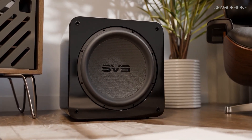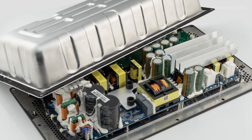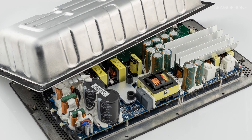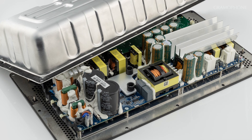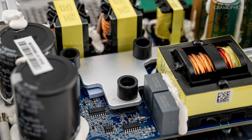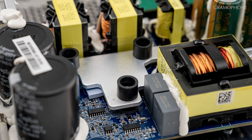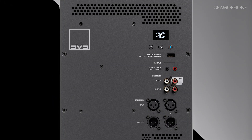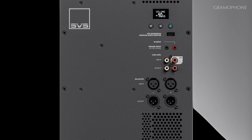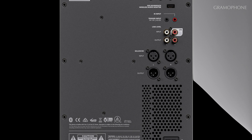Just so you don't get confused — there's a lot of technology to talk about here — it's twin monoblock amplifiers, one of which is running one of the voice coils and the other is running the other voice coil. The dual voice coil design is how you get so much copper in there that you can keep a more linear travel, because you're talking about clearly defined notes, which in a 15-inch subwoofer driver is not such an easy thing to do. I really admire the solution you guys came up with to get that kind of control, and you can really hear it in our SB17 we've got on display.